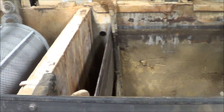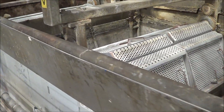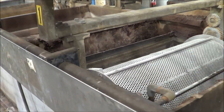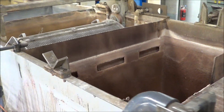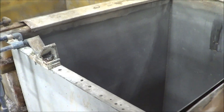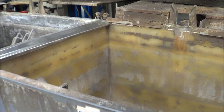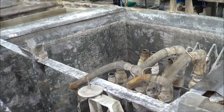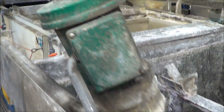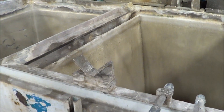Here you have a cement strip, spray rinse, alkaline wash, alkaline wash, counter-flow rinse, warm water rinse, acid rinse, and a poly tank. Here is an acid tank — it does have a mixer. This is the micro phosphate tank. As you can see, these tanks have been well cared for and are very clean.